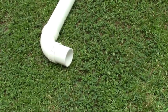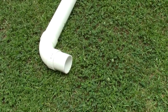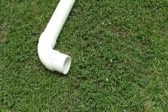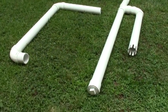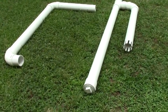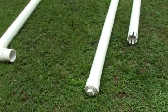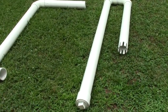When we do it all up permanently, I'll probably put some screen across the top — like hardware cloth or something — just to make sure that chipmunks, mice, whatever, don't climb up into the pipe. You don't want that inside the rain catchment. That is the theory behind the first flush diverter. If you get a really, really gentle rain, it may not fill up that pipe. You may not get anything into your rain catchment because the drip-a-second plus the volume needed to fill up this first flush diverter may not fill up — but that's okay. That's not the water that you want in your tote anyway.